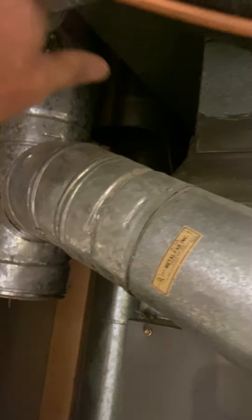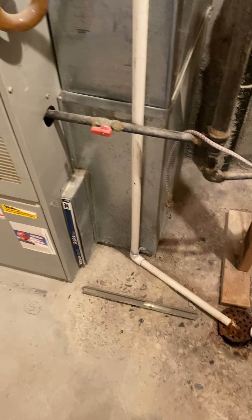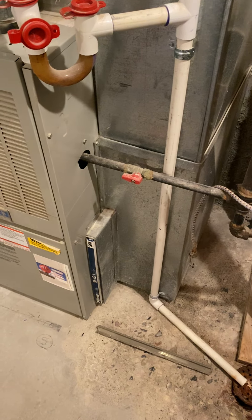The furnace flues — Dwight has them going through the storage room, then turning and going to the back instead of going out here. I looked up into the back joist space and it looks clear other than wires, so that's probably the route to use. Go to a flat termination, and use two inch PVC on that.